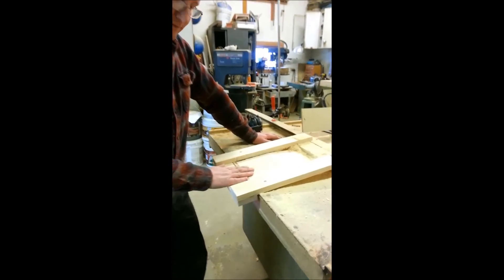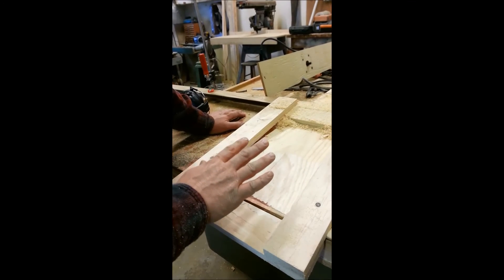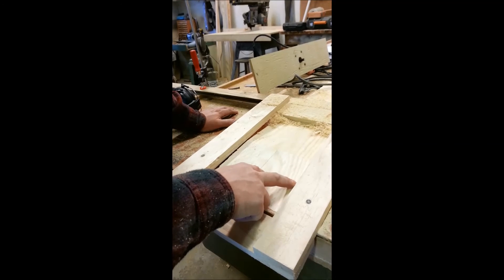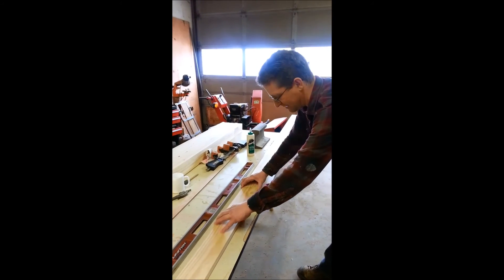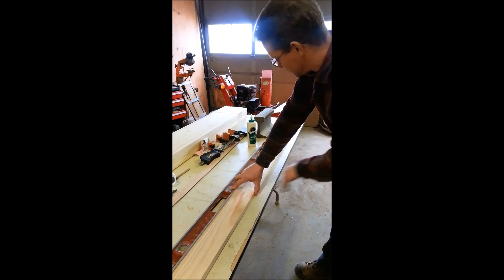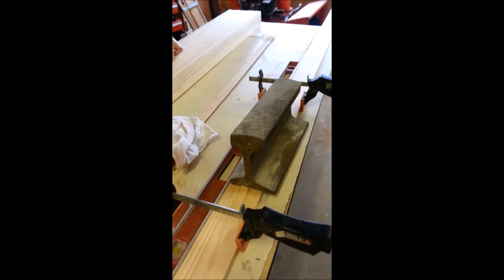We've got our first pair done. The ends are not quite perfect and square, but it shouldn't matter. If we get the boards straight, we'll be able to cut two 15-plus-foot staves out of each pair that are put together. So now we're going to glue up our staves — spread a good supply of glue on each of the mating halves, line them up, and use a level clamped to the sides to make sure they're in alignment. The rail section has a weight to hold it down so it's nice and tight. This should hold it well until it's dry.